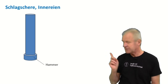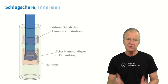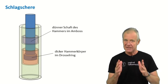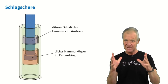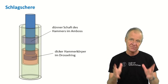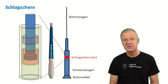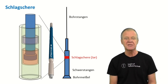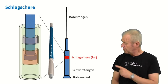You can see it here behind me now. If we look at the entire assembly, we notice that the hammer with the shaft is placed in the housing in such a way that the hammer is located in the restrictor sleeve. The picture on the left, as you can see, is just a rough sketch which is used to explain the working principle. A real jar looks like the tool that you can see in the middle. The drilling jar is placed in the drill string somewhere in the upper half of the drill collars, as you can see here.